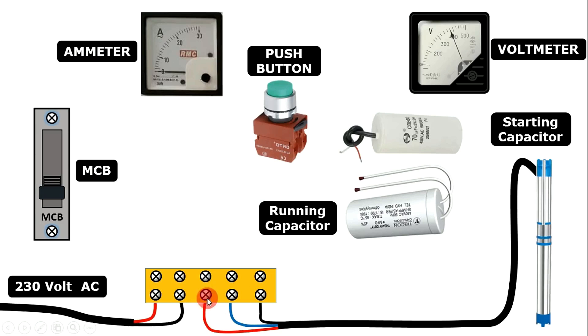In this TB, at third terminal the wire of running winding is connected, at fourth terminal the wire of starting winding, and at the last terminal the common wire. Now, from the phase supply terminal, connect one wire and provide incoming power supply to the MCB.